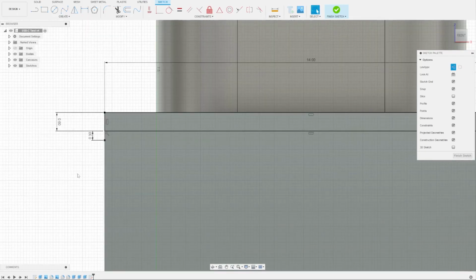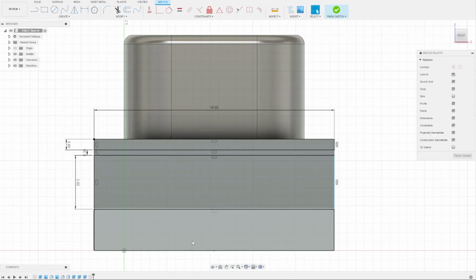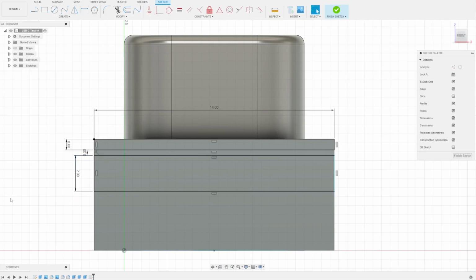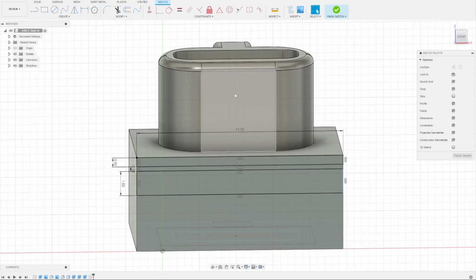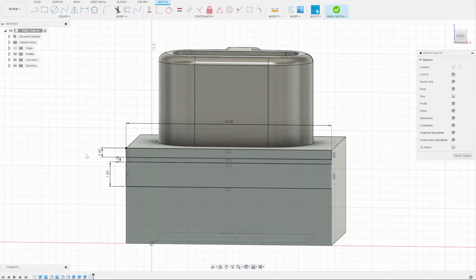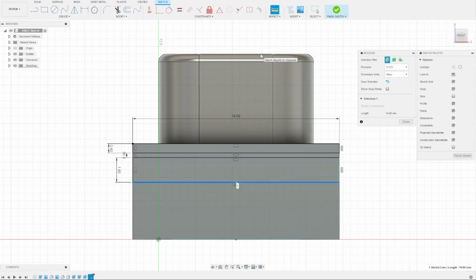So instead, I'll switch over. Maybe I'll show a little bit of what I ended up with, but I didn't record any footage of me actually doing the design. But I did it in Fusion 360, and it did end up working, but it required many, many revisions and many print attempts. I had some original failures. This is such a small part, and I tried to print it in PLA, and it turned out the PLA just wasn't strong enough. It was breaking. So then I switched and printed it in ABS and had much better success and got a stronger part that I was able to use in the final product, which we will get to shortly.